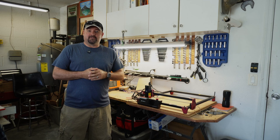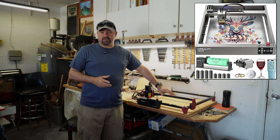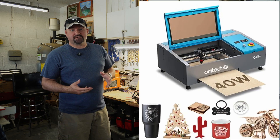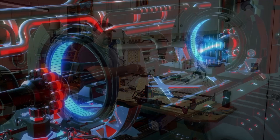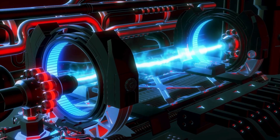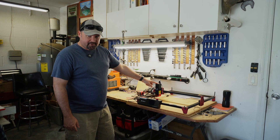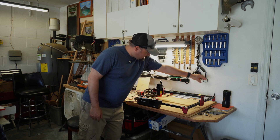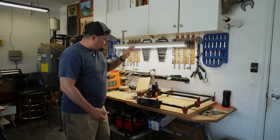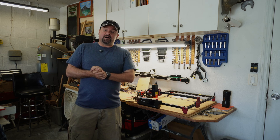First up, you've got to know your laser. For the hobbyist, there are two main types of lasers on the market today: the diode, which I have here, and also CO2. A CO2 laser uses a glass cylinder that contains CO2, which activates the laser beam and goes through a few mirrors to a focal length. The diode is different — it's just like an old-school laser pointer attached to a little gantry, so there is no back laser and no mirrors to adjust. The third type is a fiber laser, which is more on the higher-end scale and not really a hobbyist laser.